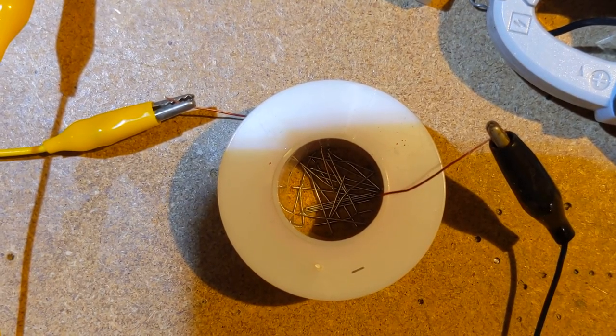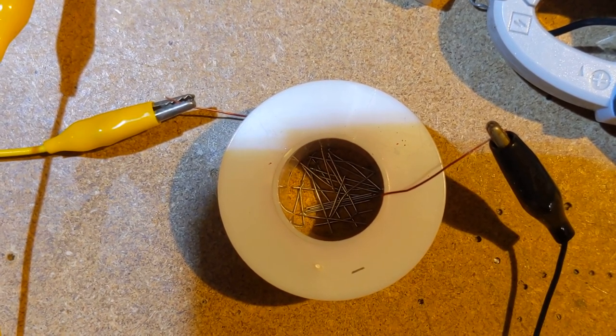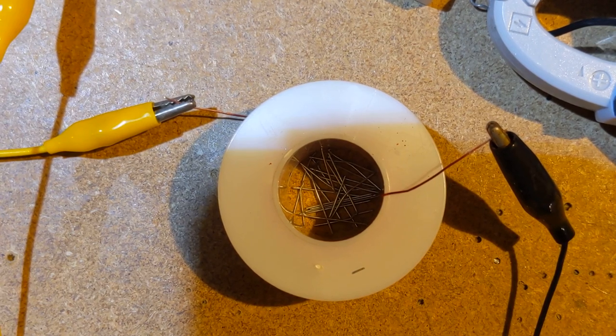So there you have it. If you have a pair of side cutters or something else that is magnetized and you don't want it to be, grab yourself a roll of magnet wire, a 24 volt transformer, and a couple of minutes, and you can fix that pretty easily.